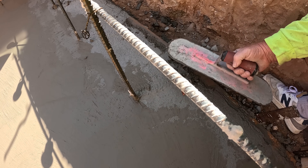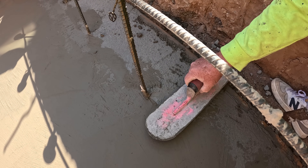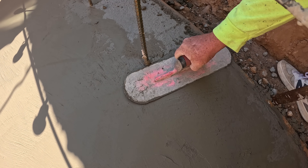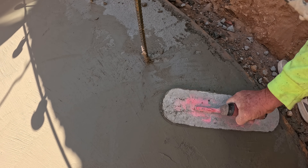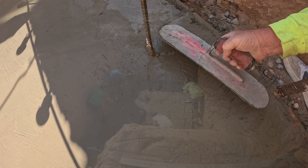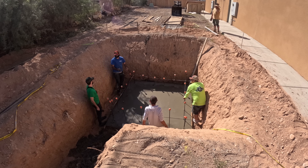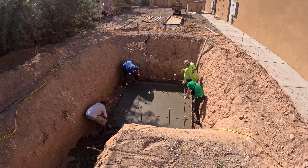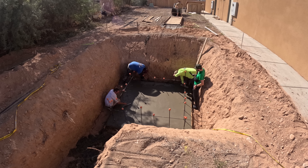It's no biggie because I'm just going to cover it in dirt when I backfill anyway. We're doing a nice hard trowel finish in here. I even have them finish the edges and around the bars because when I lay my plate down I'm going to use Tapcons to screw into the floor for the outside of the form — I want it to set nice and flat.